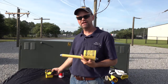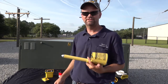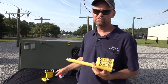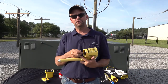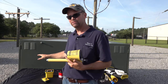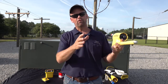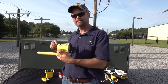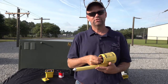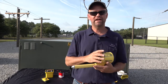We also have a 3 kV power supply on the table here, which is also going to deflect to about 7 kV. Either one of these tools can be used to test the meter. After you do a battery test, do a live potential known-voltage test, perform whatever job you're going to perform, then test the device again and test the battery again. We highly encourage everyone to use a known-voltage test before and after they use this tool.